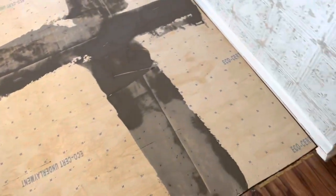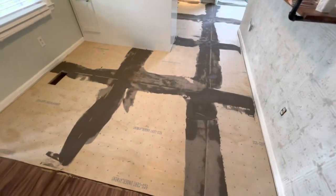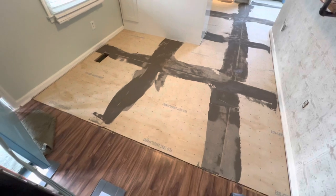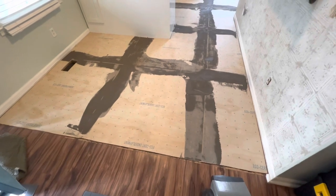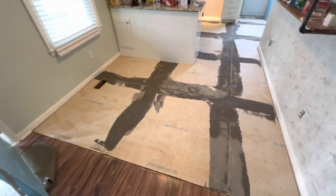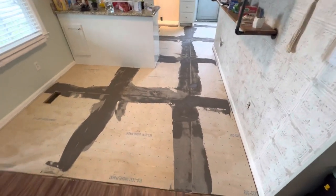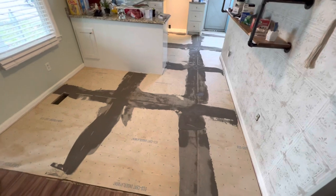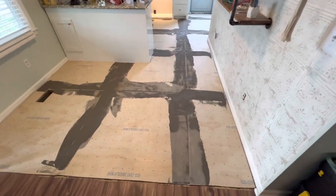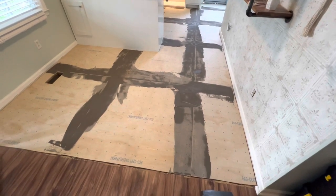Like I said, first time I tried this underlayment method — using my vinyl for a pattern — and I liked it. I came out here originally just planning on doing the underlayment, wasn't planning on doing the vinyl today. Then I thought I'd like to try this pattern method. Turned out there was some concrete I could lay the underlayment out on, so I went back and got the vinyl. Took a trip to town and got a late start, so I only worked about four hours today — underlayment down, vinyl cut in, and mud put down.